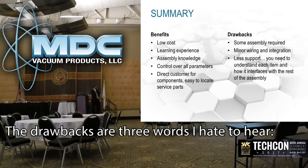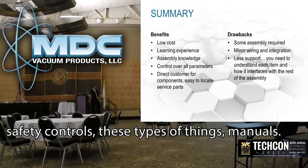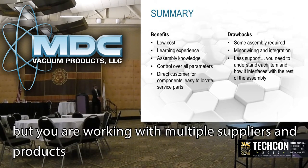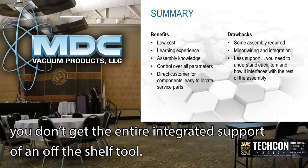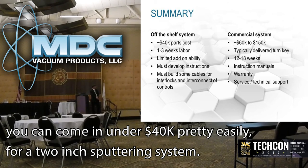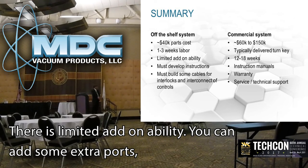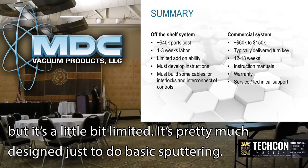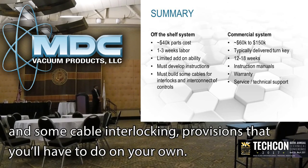The drawbacks are that some assembly is required. If you have to put the thing together, there's always some minor wiring and integration involved — interlocks, safety controls, these types of things. The manuals obviously have listed information and most suppliers are quite good at supporting you, but because you are working with multiple suppliers and products, there's a little bit of integration burden. You also get individual component support rather than the fully integrated support of an off-the-shelf tool. Assembly of a 2-inch sputtering system typically takes one to three days of labor depending on skill set. There is limited add-on ability — you can do viewport ports and play with options like rotation, but it's fairly limited and pretty much designed just to do basic sputtering. You also need to develop your own operating procedures based on the individual component instructions.